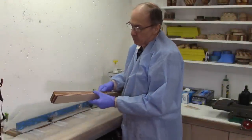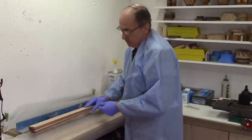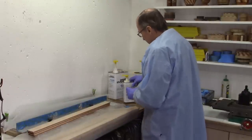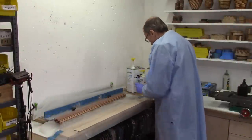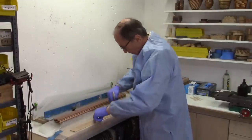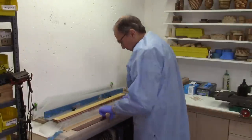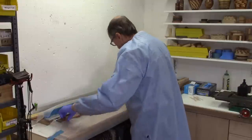I'm going to start by gluing up these 11 boards to make one laminate strip, using my glue jig and epoxy cement. Once these are glued up I'll attach them to the other pieces, using the West epoxy system. I cut a total of 11 wood strips for each of the required laminate boards using the AccuSlide system. The wood strips varied in thickness between 25 thousandths and 75 thousandths of an inch and were arranged to provide a contrasting color between each of the laminate wood strips. I then apply epoxy to both sides of the wood strips using an inexpensive brush.